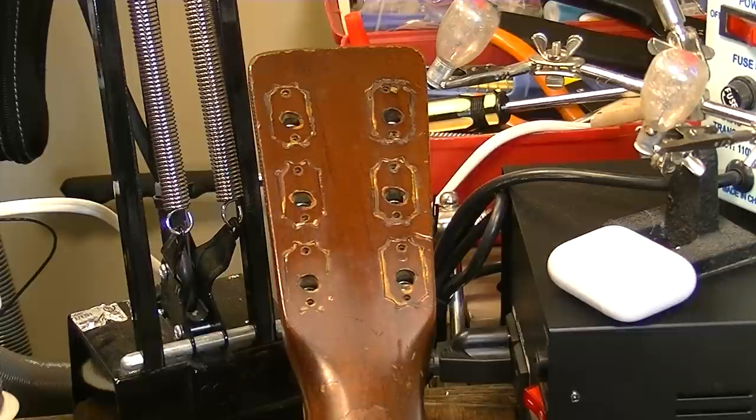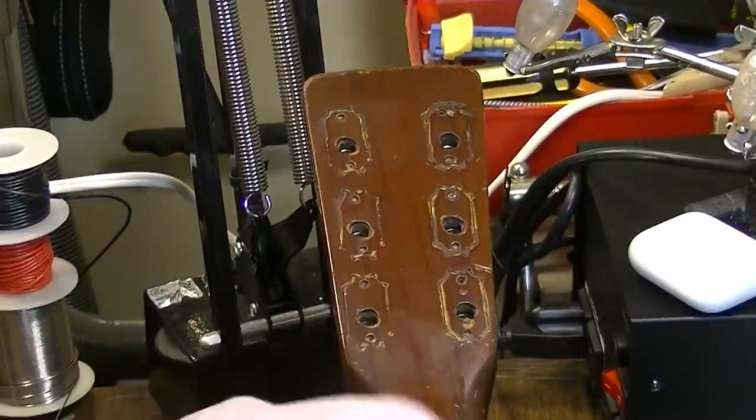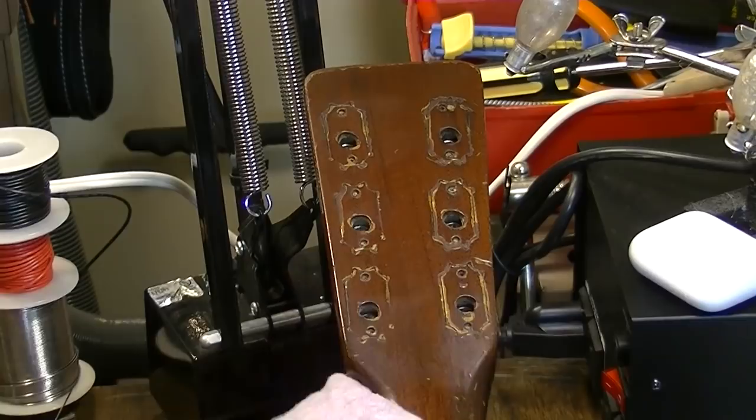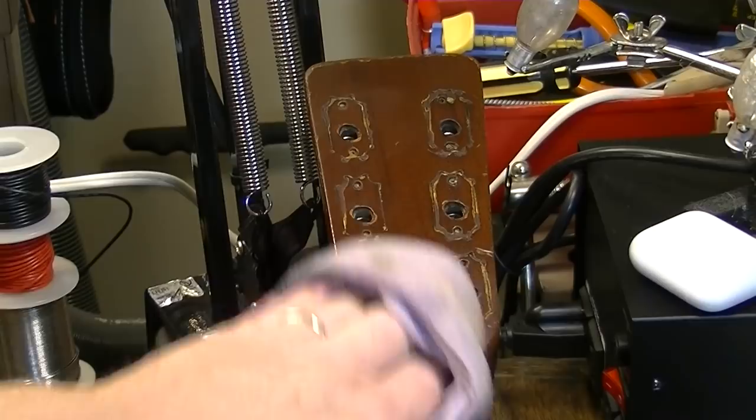It is mildly abrasive, but it's abrasive at the sub 2000 grit. So after you go 1000 grit sandpaper, 1500, 2000 grit sandpaper, then you come back with this stuff and it really polishes it out and takes all of your sanding marks out if you're doing finishes. The other thing about this stuff too is if you have a really light overspray on a vintage guitar that you want to get rid of, this will also get rid of that overspray. It will actually kind of melt it into the old finish.